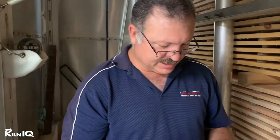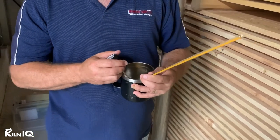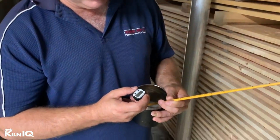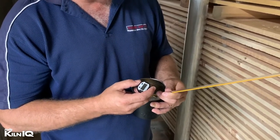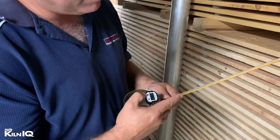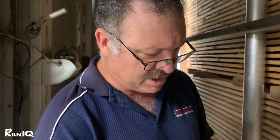What I like to do is take a thermal cup and put hot water into it. For the wet bulb that runs in this kiln, I try to get the water to more or less the range that the wet bulb will be working in — in this case about 57 Celsius. I'm checking my thermometer against the other one; this thing is very difficult to read inside a kiln in the dark. We are at 56.7 Celsius on the mercury thermometer and 56.5 on the digital one — to me, that is accurate enough for the test.